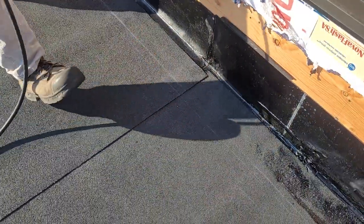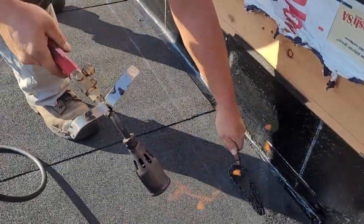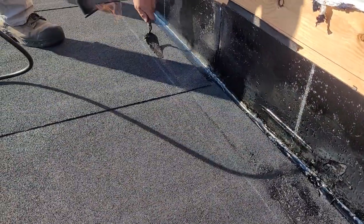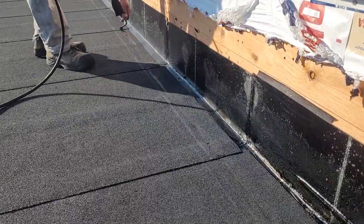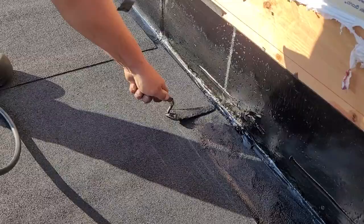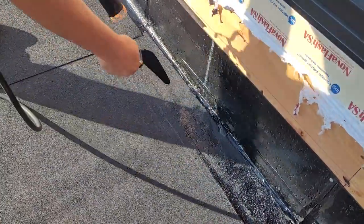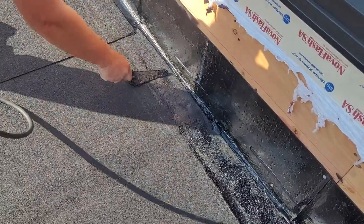Keep in mind where it's hot — obviously it's hotter back where you started. If it's getting too hot, move down the way, let that cool down a bit, you can always come back. I switch my hands a lot of times — trowel in the right hand, torch in the left.